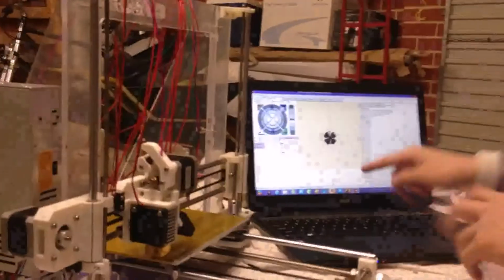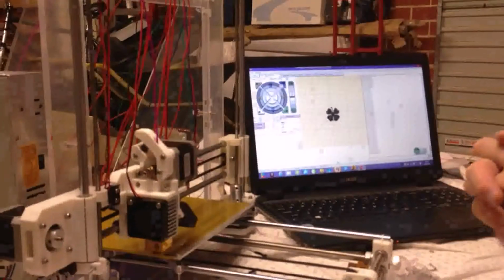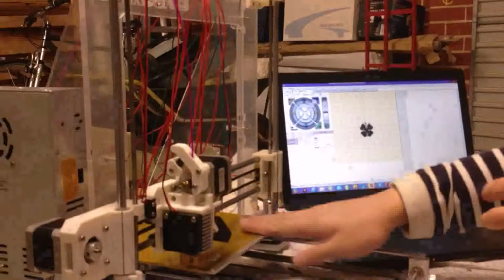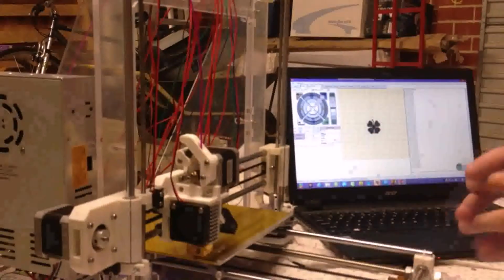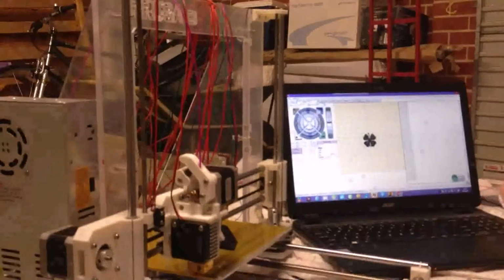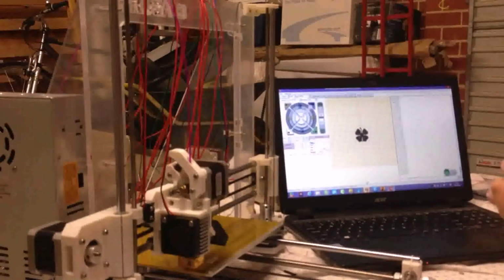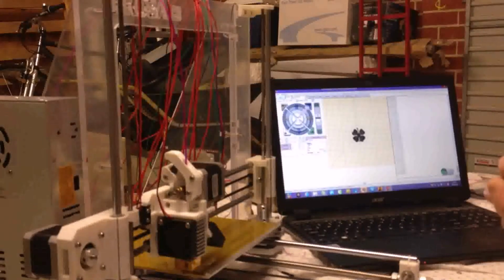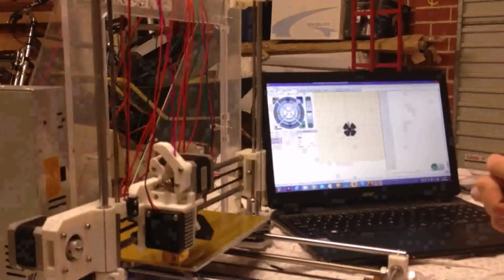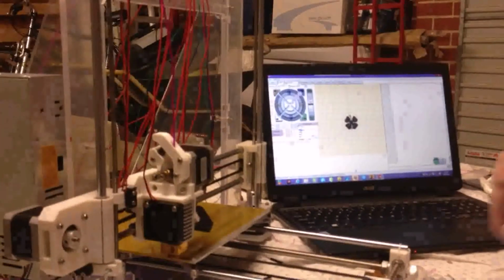So now it's increasing the temperature of the extruder, and sometimes you might wait 5 to 10 minutes for the hot bed, because the area is so big, so it takes more time to warm up, and the extruder is very easy to warm up. And now it's 37, 39, 41, 43, 45, and it continues until it reaches a temperature of 180, I think 185 for PLA material.